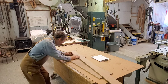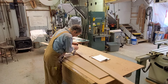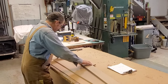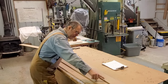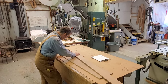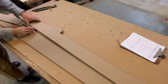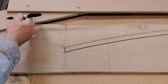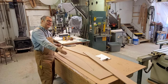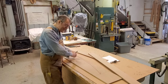I'm going to mark that point right where that nail is, then go ahead and pull that nail out, leaving my other two points in. I'll use the magic marker — hopefully you can see — but by sliding this down and keeping these two contact points touching the boards, you're going to get an arc. Watch this — there you go. That is a perfect radius at ten feet. The ten feet isn't really the issue; it's the chord and the height that's the point here. But it is a perfect radius.